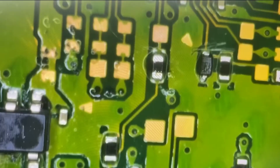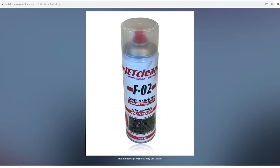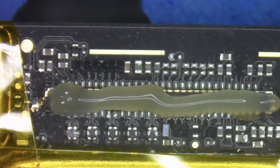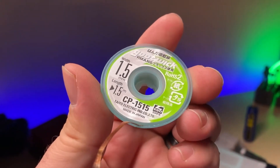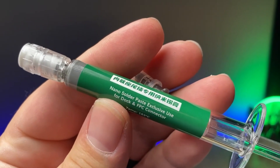Having a good brush with clean room wipes and isopropyl alcohol or other flux cleaners like the Falcon 530 will allow you to prep the area for a new component, clean away burnt flux, and is useful throughout the entire process. The longer you leave flux on the logic board the harder it's going to be to remove, so you'll find a balance of cleaning the flux, adding new flux, cleaning the flux, adding new flux throughout the entire process — because flux is your friend, but you have to treat it with care.